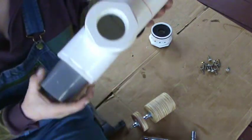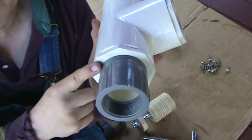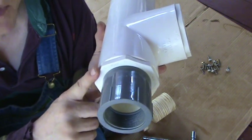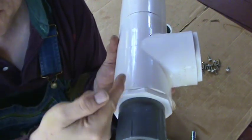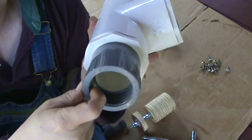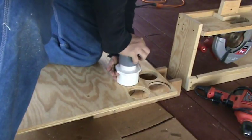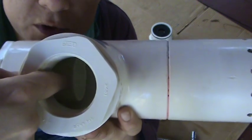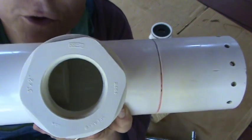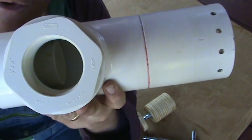From a theoretical standpoint, I'm going to give you a close-up here. In this end, I've got a piece of two-inch pipe going into a three-inch tee — that's a three-inch to two-inch slip-to-slip bushing. I had to cut out the little ridge inside the back of the bushing so I could push the pipe all the way through. I put a two-inch slip-to-thread converter so I can screw barrels on, slid that two-inch pipe through the bushing, and you end up with a piece of two-inch pipe stopping about halfway through the tee. It should be absolutely dead square and flat, and polished highly with some steel wool so you get a nice, smooth, glassy surface.